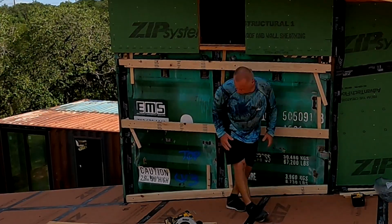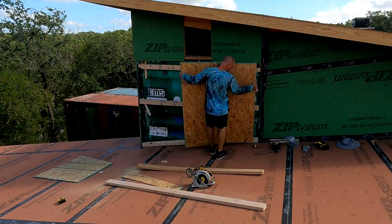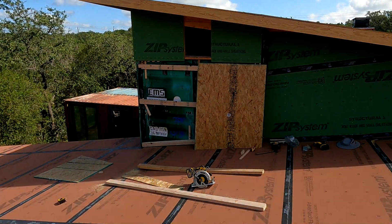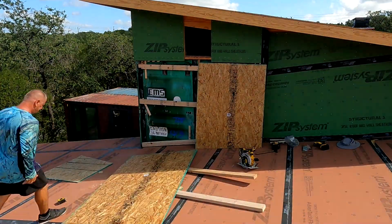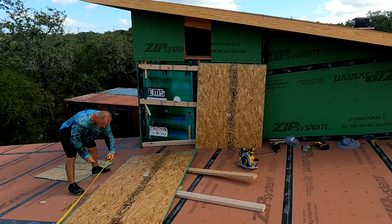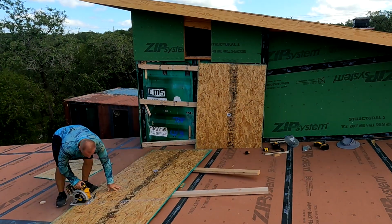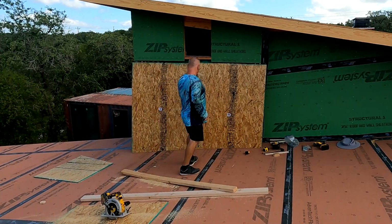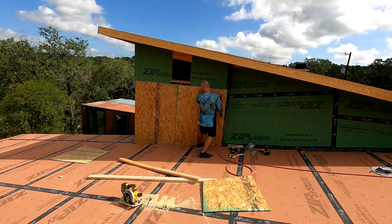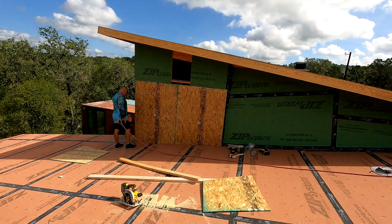And I'm trying to figure out what to do here. One particular item, too, is I'm cutting this regular half-inch OSB. $17, yay. Dropped quite considerably. Anyway, I'm putting it in. I put the two-by-fours up into the container using sheet metal screws that go through and into metal. So they're specialized screws. They're kind of a pain to use because they sometimes don't bite into the metal and you ruin a couple screws before you do. But anyway, they're huge. They hold really well and done.